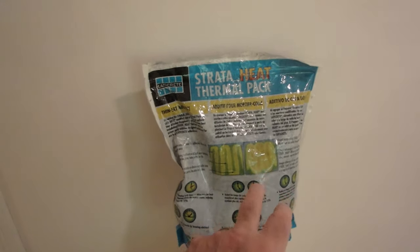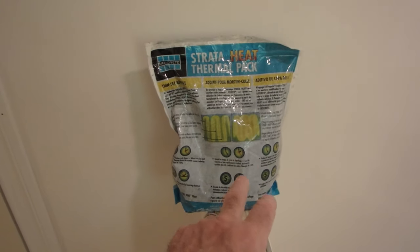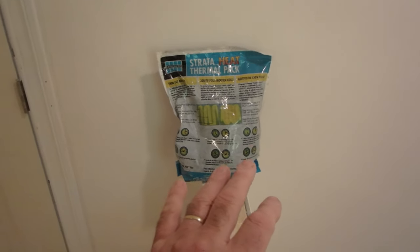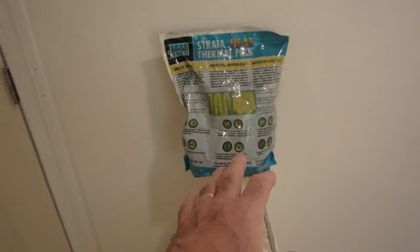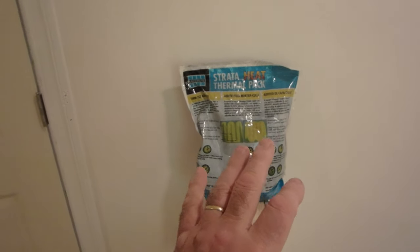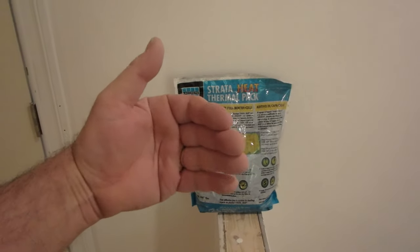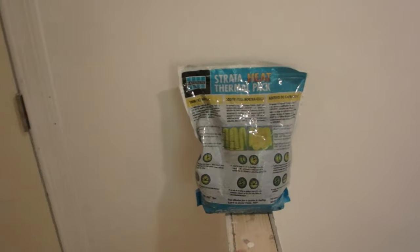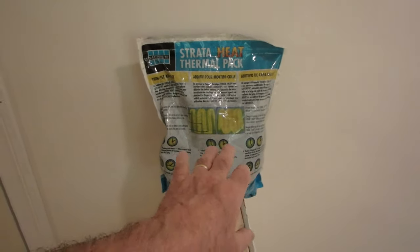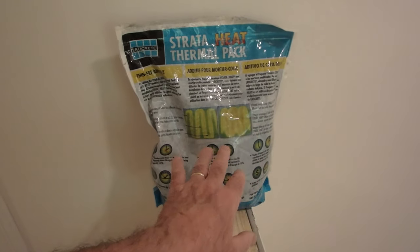The other time you don't want to use this is if you're using a Carrara marble or a marble, you always use white thinset. Carrara marble is translucent. It doesn't mean it's transparent. It just means if you put a light behind the tile and you shine it through, you're going to see the light through the tile. So the color of the thinset is important when you're doing marble tile. So you don't want to use this if you're doing a marble tile or a natural stone tile.